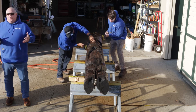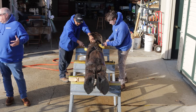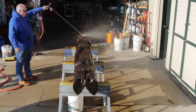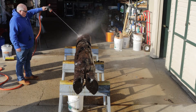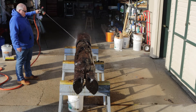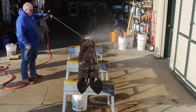Always start out lighter and go stronger — if you start out strong, you can't go back. This way you work your way up. For rinsing, I put a little bit harder pressure on the garden hose to rinse and get it nice — all the wood fibers off, and in between all the carved areas and letters should come up really nice.